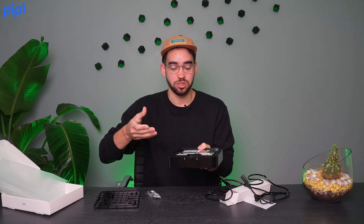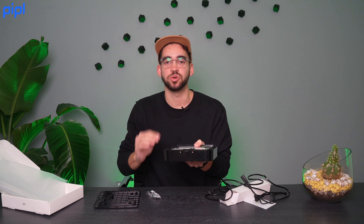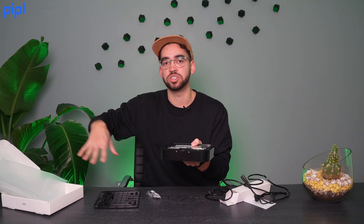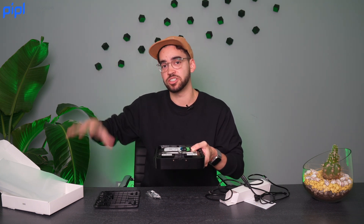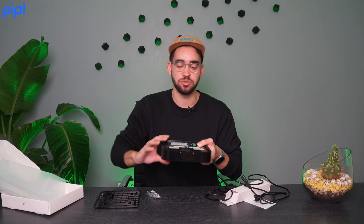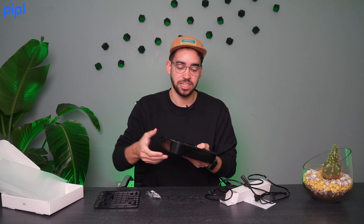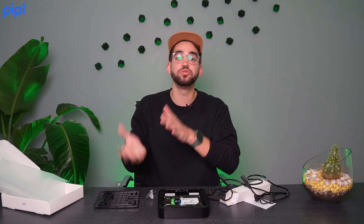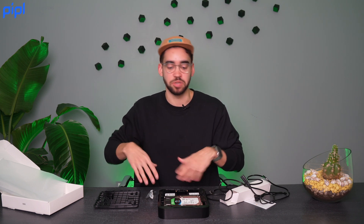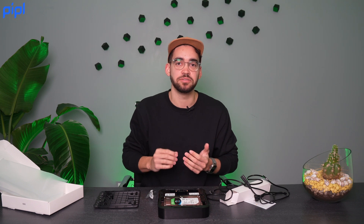As you can see, there are no PoE ports inside this NVR, so it's important to have an external PoE switch to connect your cameras. The HDD doesn't come with the NVR and the PoE switch doesn't come with the NVR, so make sure you have those before doing your installation. Also, put your cables in first before powering on because the disk is spinning — you don't want to flip the NVR around as it can break the HDD pretty easily.